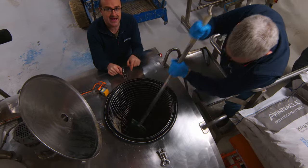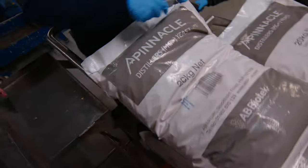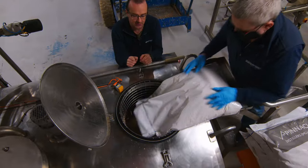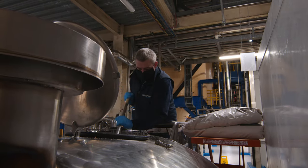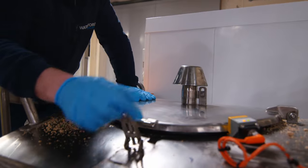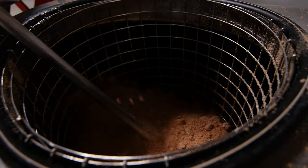There's eight hectolitres of de-aerated water in here and we're mixing 12 bags — 240 kg of compressed yeast in here. It'll mix for about 20 minutes, timed with the wash coming out of the mash filter. That's your yeast in compressed form. When it rehydrates in the water, we then add it to the sugary wort and your sugars start mixing in with the yeast cells.